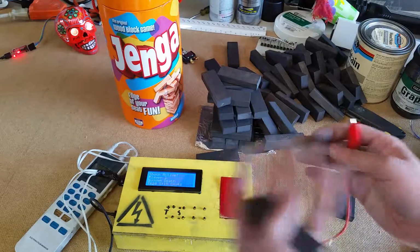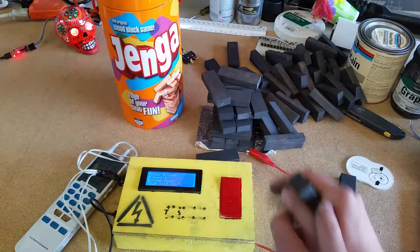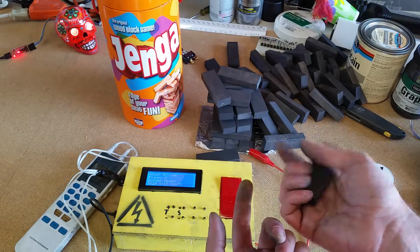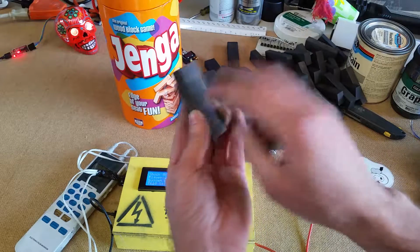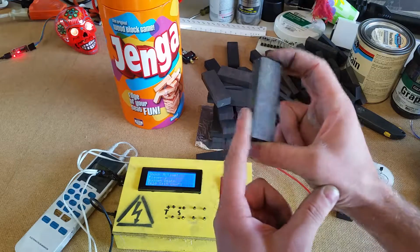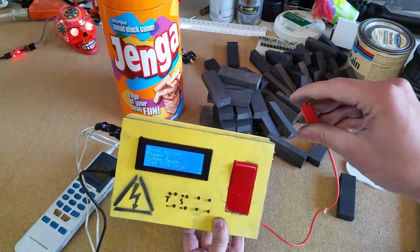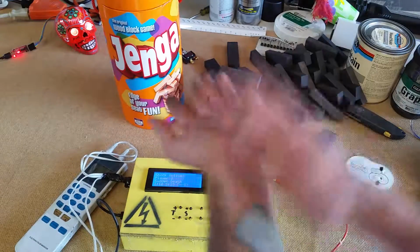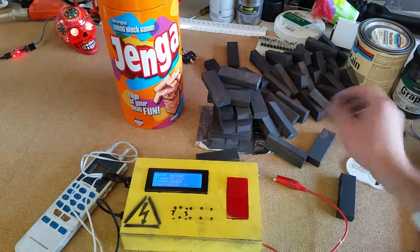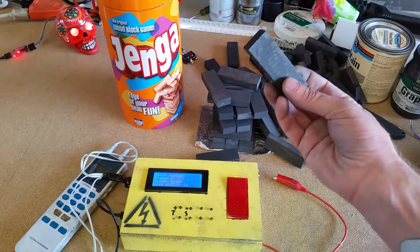I mean, that's my understanding, because capacitance is detecting how much charge something can hold, so we're sending charge in, or seeing how long that voltage takes to build up. And that requires a certain amount of conductivity on these electrical blocks. Now, this can easily detect when you are touching it, because there's a certain amount of surface conductivity in your skin. It's moist and everything, but a normal wood block just isn't necessarily that conductive.